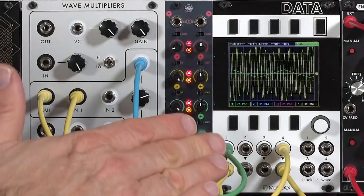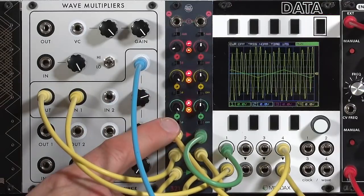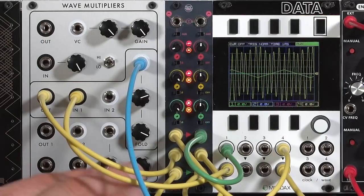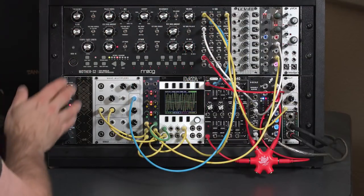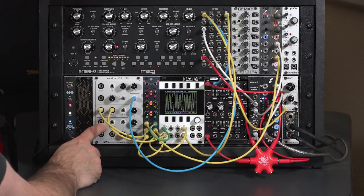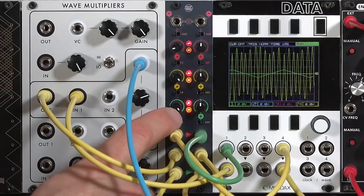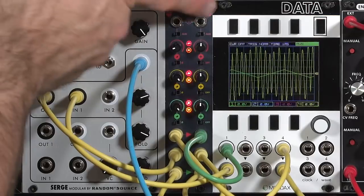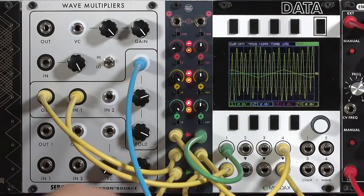So that's why in general you should have utility mixers in your system. You really want a utility mixer that can do up to two times amplification at a minimum — to boost signals to overdrive things on purpose, or to boost the outputs of particularly soft modules. I really love the 321 because it has all these great features: the phase invert, being able to turn the offset on and off, and these summing buses that are semi-normal if I want, or which automatically mix together all the outputs I want. Very nice little module.